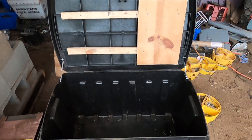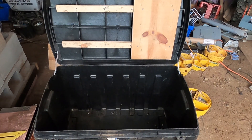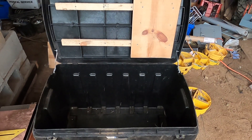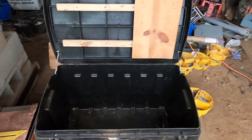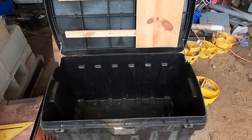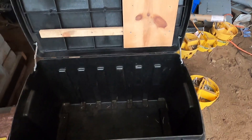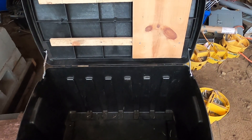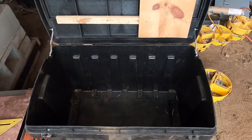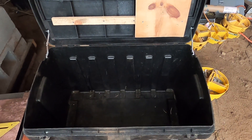The project today is to build a 12-volt full-featured battery system in a box. I've got a 12-volt lithium iron phosphate battery put together using Eve 280 amp-hour cells, and I had this old plastic toolbox laying around. I'm going to cram as many components in here as I can: a Victron 12-volt 1200VA inverter, a solar charge controller, an AC charger, and various control items.